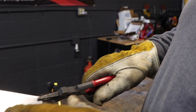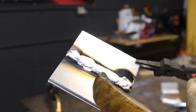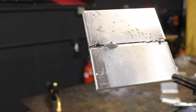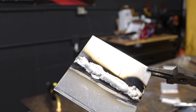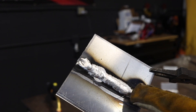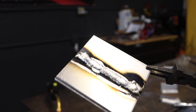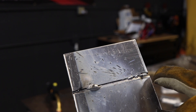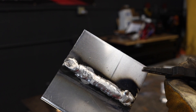Got a little too trigger happy right here and burned a nice hole in it, which then you heard the frequency drop and I filled that hole in — there's the hole I burned through. But other than that, the top looks good. Here's part of my start of my run in on the tack. This looks like an appropriate weld on the top. The back side, you see it came through where I put the hole in, and then you have the oxides on the bottom. So we're going to back gouge this now and clean this up and then weld the back side.